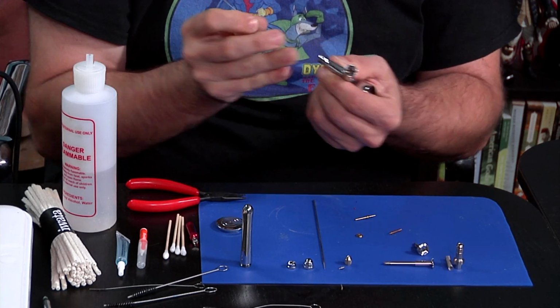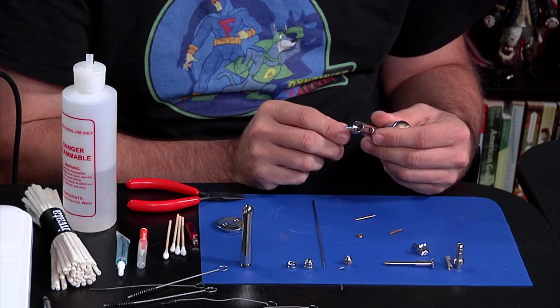Is there anything you should be worried about, like any type of solvents you shouldn't use? For example, we're talking about cleaning when we're using acrylic paints. If you're using different types of paints, is there a different process? Whatever paint you're using, you want to use the appropriate solvent. Some paints will set up and they're really hard to get out, like silicone paints. If you let it set up in there, sometimes the silicone will bind to the coatings inside of here, which makes it hard.